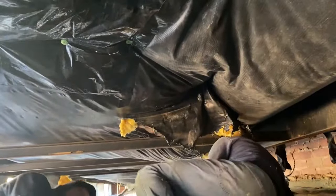Okay, y'all. Finishing up the plastic under it. Plastic laid out. One around all the piers. One around the anchor. Got it pinned down. We're using fabric pins, but they're actually like a staple. He's putting one in. This is the big staple you put in. They're designed to hold down sod and like a landscape fabric. But we're using them under here to keep the wind from blowing it away.